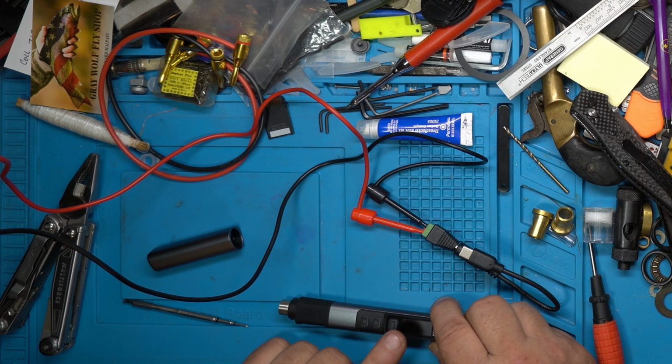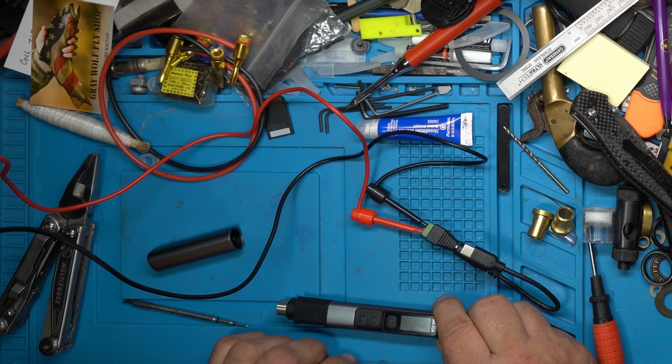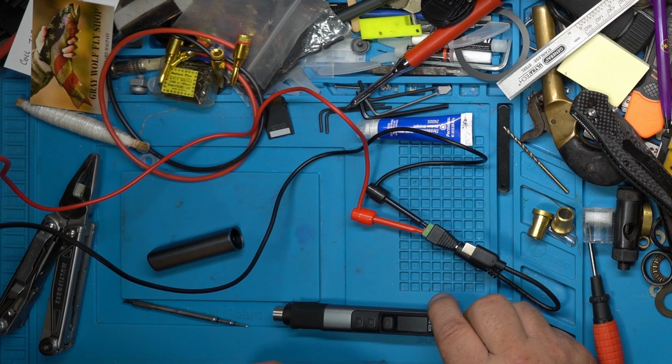So it seems like the iron is trying to figure out how fast it can start at whatever your power supply can handle while adjusting the power setting on the iron. And so when it's all said and done, that's why your power setting on your iron is lower than 100%. You see in all these tests we're doing that it doesn't change, because adaptive power figures out, okay, this is where I have an issue. I'm not going to set the power any higher than this. And so each time you restart your iron, it stays set at that lower power setting.